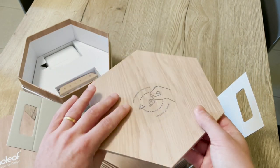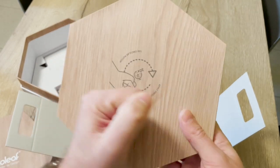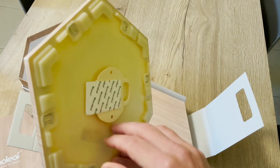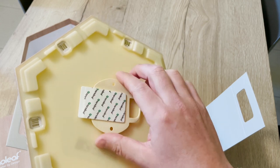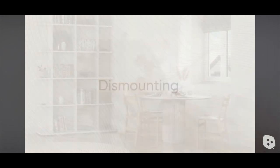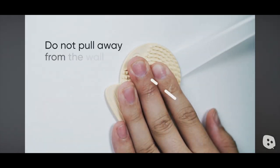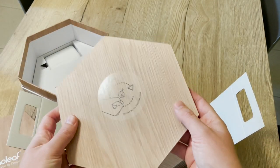To show you how to install them — it is really easy with 3M tape. You stick it on the wall, push on top of it, and you're done. You can also easily dismount them by lifting the tile. This piece will stick on the wall and you can pull the 3M tape off without damaging your wall. Follow these directions carefully: gently snap the panel off the mounting plate, place one hand on the plate and with your other hand pull the exposed half of tape along the wall. Do not pull perpendicular to the wall or at any angle or you risk damage. You could also use screws, but those are not included in the kit.